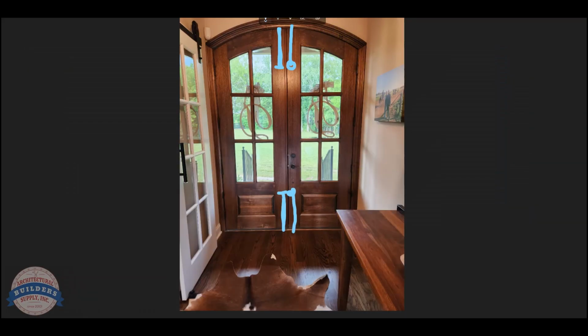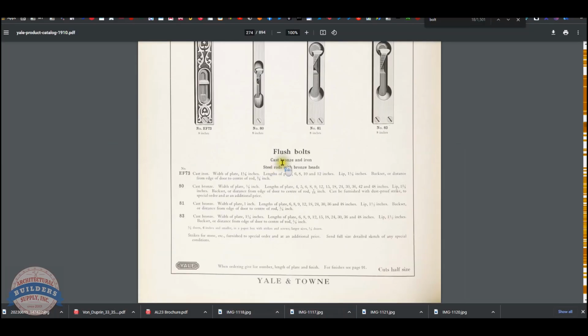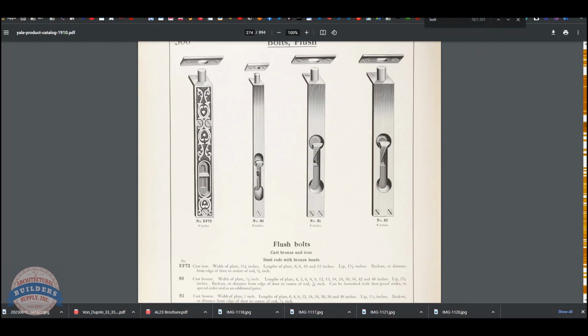I've seen it. I can think of 4 instances off the top of my head where I've had to help clients navigate around that problem. And one job that we did for a guy in California, it was hitting when the door got to about 75-degree open. So what we did was sell him 1.5-inch offset pivots, and he was able to mortise it such that the vertical axis of pivoting allowed that door to kick out and around that, and it worked perfectly. He was thrilled with that solution. So I might consider a more elegant solution like that.